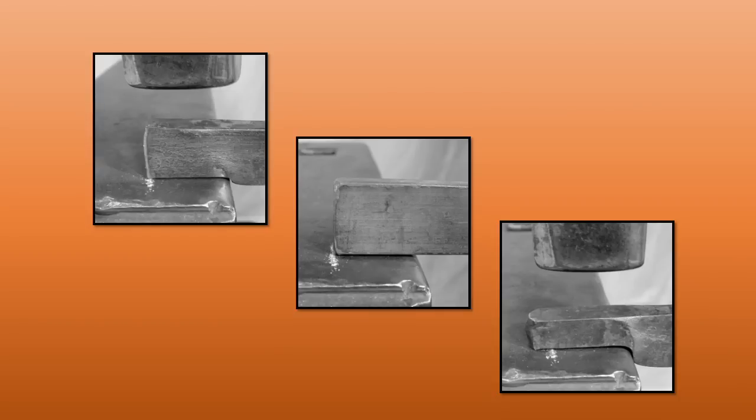With this particular pair of tongs made from inch by 3/8 we're going to forge it on its side, and I want you to deliver half-face blows — which if you look at the top left slide, my half-face blows are more two-thirds onto the anvil, one-third off. Bring the stock down until it is half its width, basically ending up with something that is half an inch square. As a side note, if that's 50% of the original stock and 25% is gone, you've got about 25% elongation — just something to keep in mind.